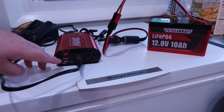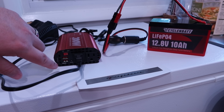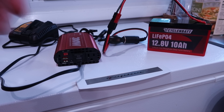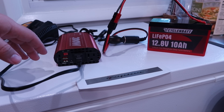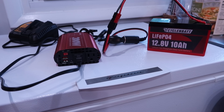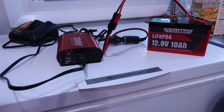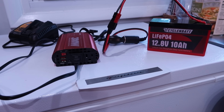The silver model has USB 3.0 power delivery that'll do 30 watts, and then a USB 3.0, and they're in the vertical orientation. The red model, which I bought, just has dual USB ports at 2A. When I bought this it was $35 on Amazon — there'll be a link in the description. It claims 300-watt rated, 600-watt peak, dual DC 5-volt 2.4A max USB with auto-detect, and a nominal input voltage of 9.8 to 16 volts DC. It claims max efficiency of 91%, though on their bigger model I was getting a whole lot less than that. There's another video of that — a 2200-watt one — on the channel.